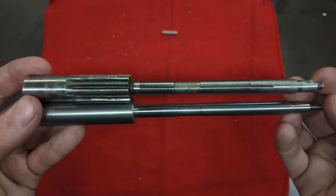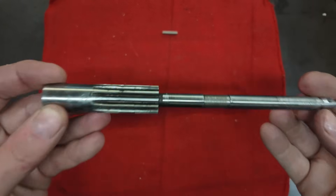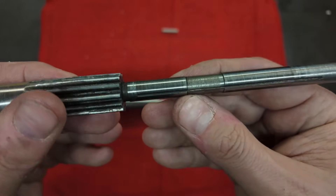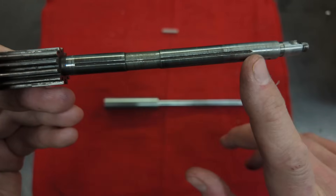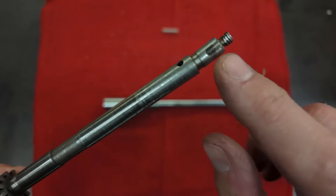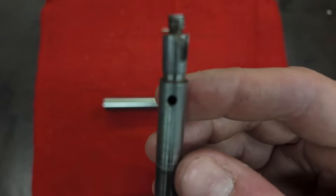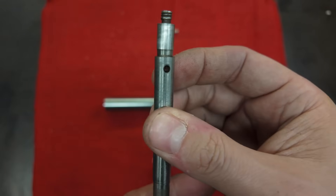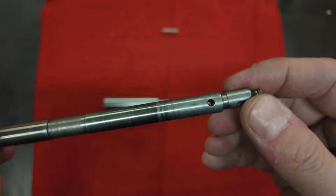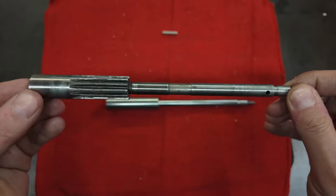I think we're actually starting to get somewhere. It's starting to look like what it's supposed to look like, so that's always encouraging. At this point, there are really just a few things left to do. Of course, I still have to add the gear. There is also a small oil groove that runs the length of this section of shaft here. There is another small keyway down at the end here — this takes a round key, and this is what locks the hand wheel in place. And then there is also a small hole through the end of the shaft. I'm honestly not sure what this hole is for, but I'll go ahead and add it — I don't want to leave it out and have it be an issue. So I'll get this thing set up in the mill and we can knock out these last few features.